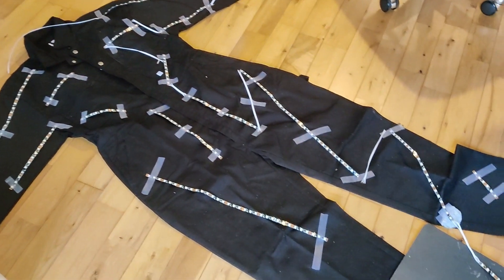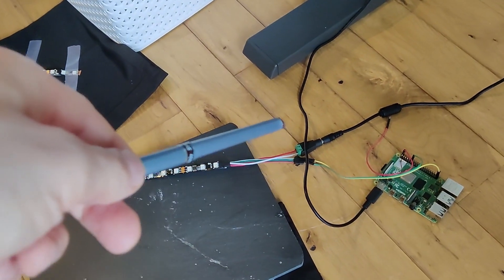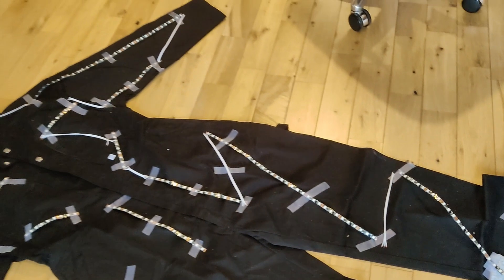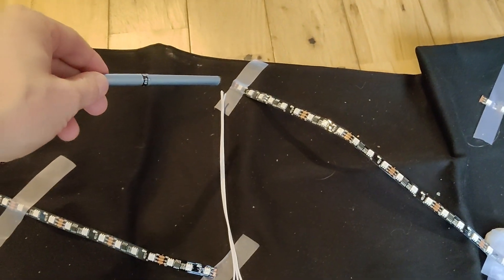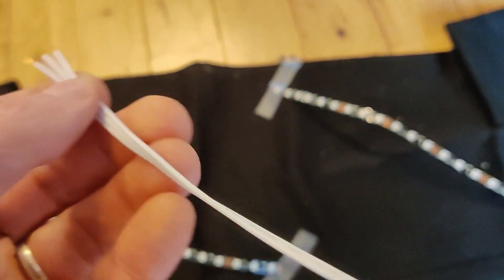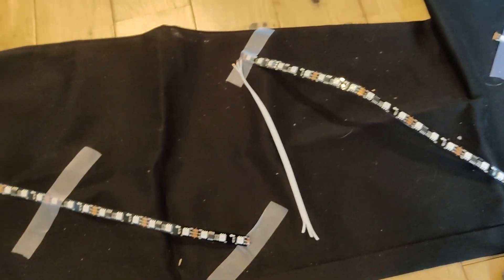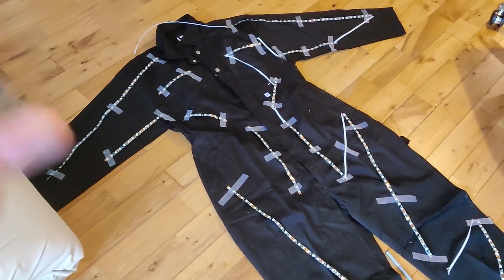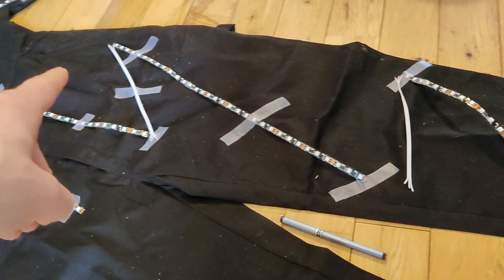Let's have a look at how we're creating this dance suit. Down here we've got a Raspberry Pi, then we've got LED connections, and I have split the LEDs apart and laid them out on the suit. I need to solder in each of the connections together — I've got three separate wires in one so I can join the ground, the data, and the 12 volts to each end to complete the circuit. I've tested the Raspberry Pi and this connection works, so the next job is to solder in everything else.